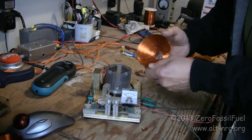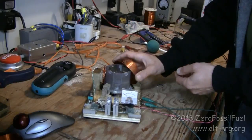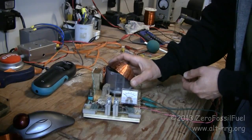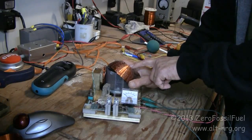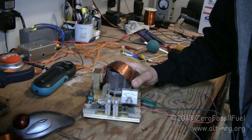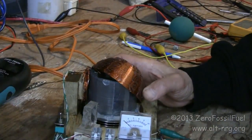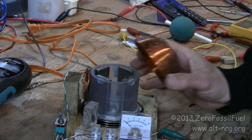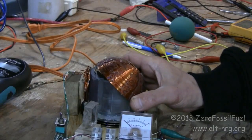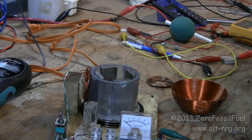I don't think that will induce a voltage, but I'm actually going to try that anyway just to make sure. I had the top edge practically rubbing against the bottom where the center of the coil is — I couldn't get it any closer. You can get an idea of just how deep I was able to get this thing inside the coil, and really very surprising results — I had literally almost null voltage, almost a null effect.